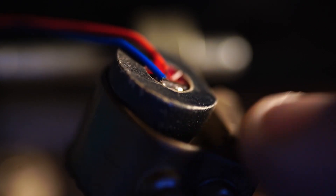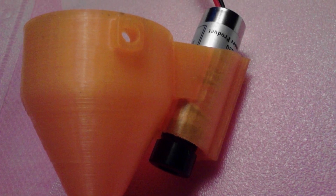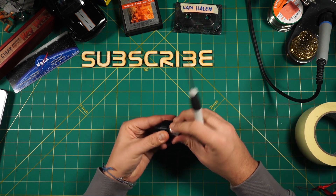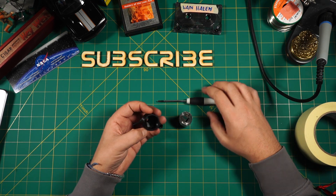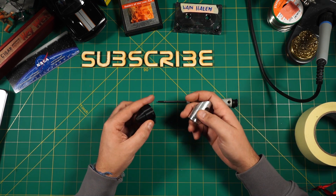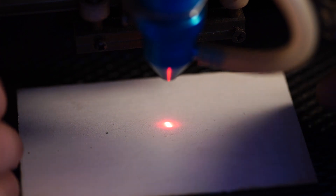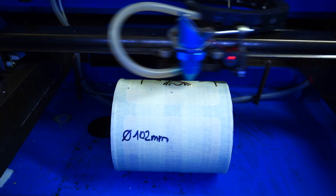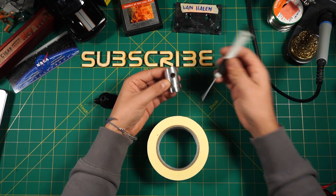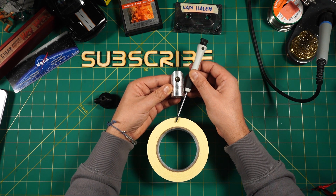I tried a 3D printed attachment for the laser that holds the laser diode in place, but there is no way of adjustment. Those parts are cheap and are not threaded over the bottom laser head, but simply held in place by a set screw. So pointing the red dot in its perfect position takes a lot of patience. Also, depending on the thickness of my working piece, the red laser beam hits the target at another angle, giving you a wrong impression of where the K40 laser beam will hit it.